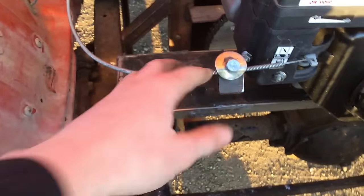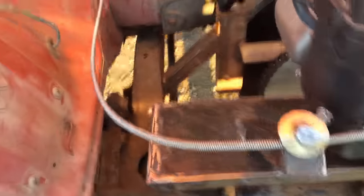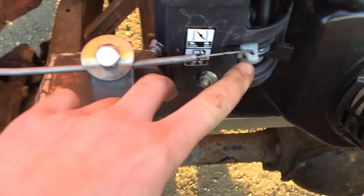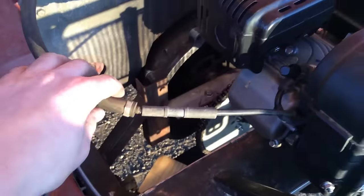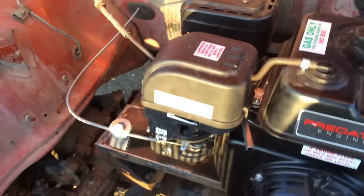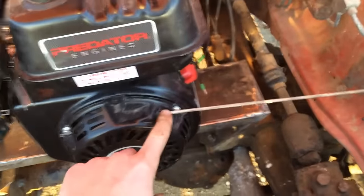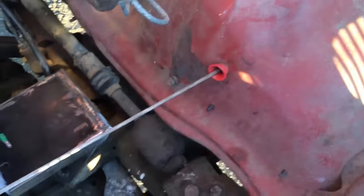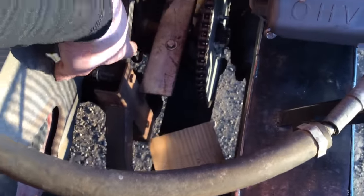So here's the choke — there's a little tapped piece of metal and a vent washer. It clamps onto this choke that runs into the inside, and I drilled a little hole in there and then it runs through there. This was the original throttle cable that I just hooked up to the original Predator throttle mount, and that runs inside to the pedal. I ran the pull cord through here and there's a little piece of plastic so I won't cut the cord, and then there's a kill switch wired there.